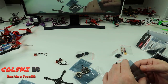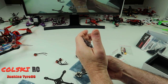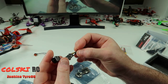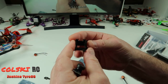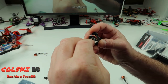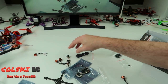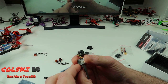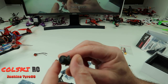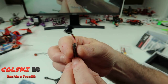The camera it comes with is the Caddx Beetle V2. It's kind of an all-in-one but split into a board. This frame bolts on top of your stack; the camera goes in here into the TPU mounted holder and the board sits alongside it. It's a 1200 TVL PAL camera and it is 4:3 — this does not do 16:9. I think it's 25 milliwatt, possibly 100 milliwatt.